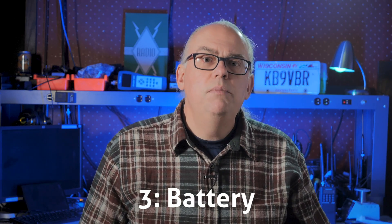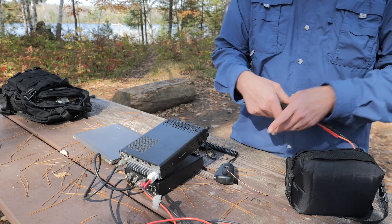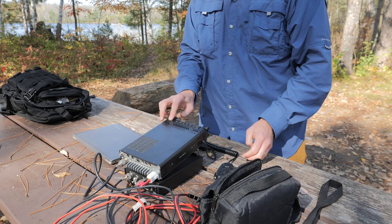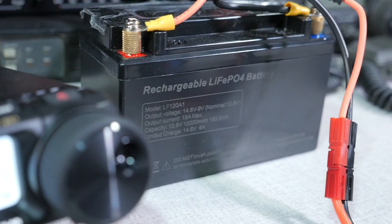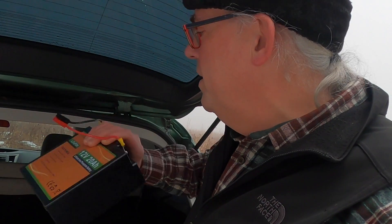Power is necessary, and in the field, battery power is king. In most cases, a 12-amp hour lithium-iron phosphate battery will give you a couple hours of operating time, and if you turn your transmit power down to 50 or 25 watts, you can extend its life even longer. Lithium-iron phosphate batteries have become quite inexpensive, and their lightweight and long-life make up for the cost difference compared to a 12-volt AGM or marine battery. I use a 12-amp hour battery myself, with a link in the description, and also a 20-amp hour battery for longer activations. These lithium-iron phosphate batteries are lighter, last longer, and charge faster than the AGM batteries I used to use.